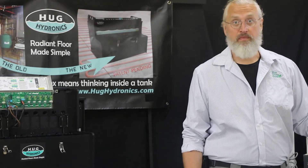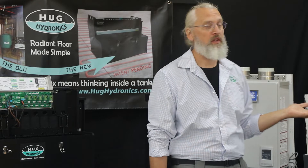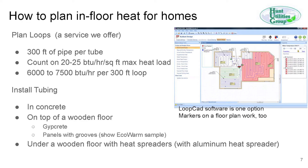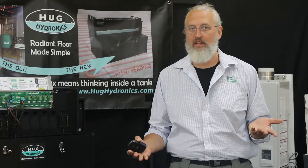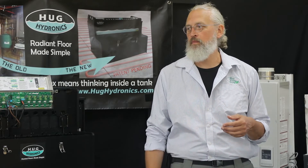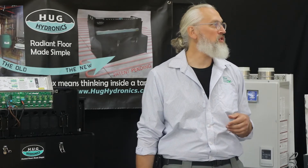When planning, it's important — like any construction project — to have some guidance to make sure it goes really well. The loops in the floor are the main thing. 300-foot loops are a rough guideline for the maximum length you want. You can do 350 feet — our pumps are particularly suited to handle slightly longer loops than 300 — but 300 is a really good guideline. The longer the loop, the more resistance and the slower it flows. You want as much water flowing through those loops as possible.